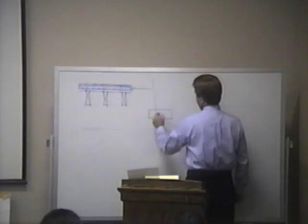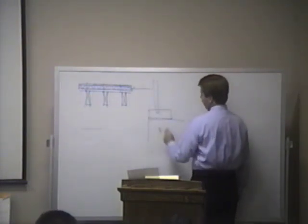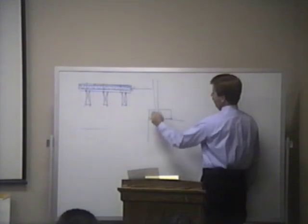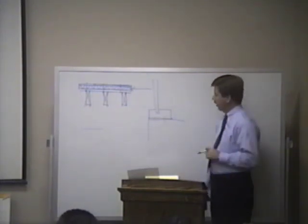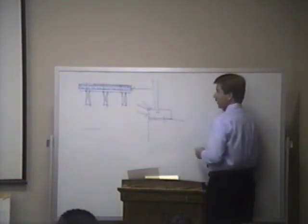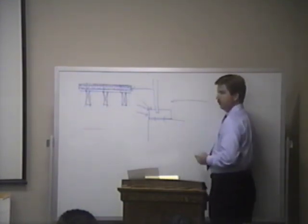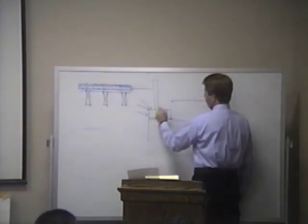you've got an aluminum frame here, and here's your slab, or anywhere on the building, there's your glass pane, and that's shot down to the slab, with different attachment systems. Well, this is hollow. There's nothing there. Every one of those things is hollow. And it's not uncommon to see condensate build up around windows. It's because you get the heat and the moisture of this conditioned space, and you get that cold, dryer air in the winter, and you'll get a little condensation.